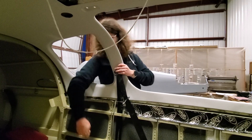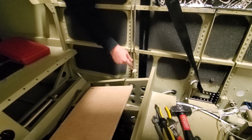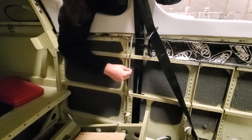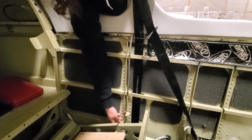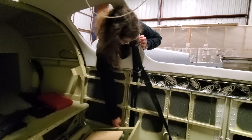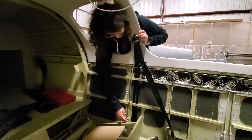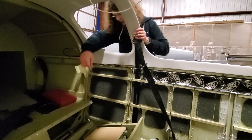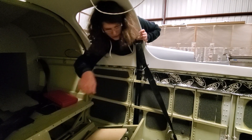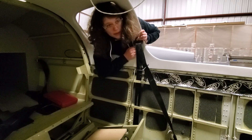Yost heroically tightened the bolts underneath here — the bolts that hold the parachute cables. The instructions were pretty sparse. We ended up having to file up here so that we could have enough length of the cable to get all the way down to the bottom. We ended up using AN5-15 bolts with two washers on this side and one washer on that side, and a lock nut — that was just about the right length. Then we torqued this bolt with an extension and a torque wrench.